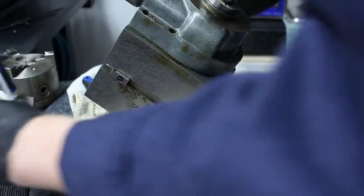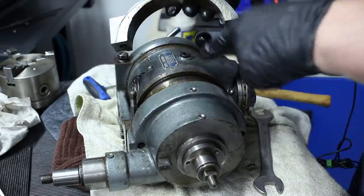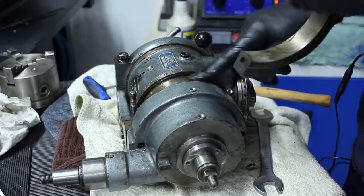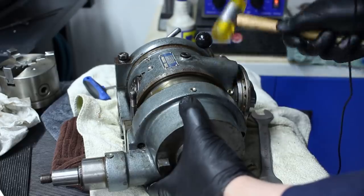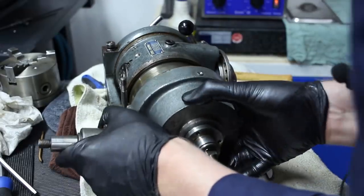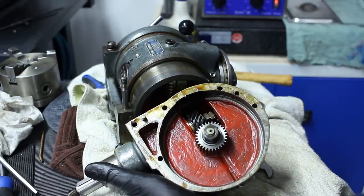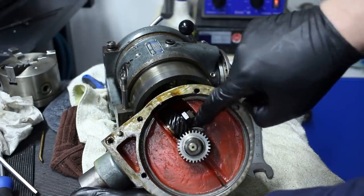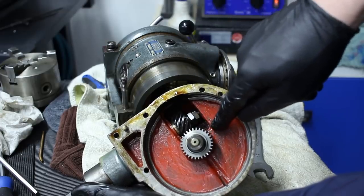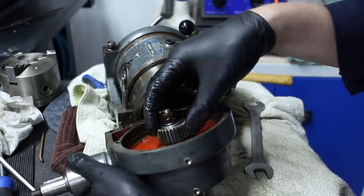There it is — that's the clamping element. Very nice machining on the inside, and this is ground. There is the smell of old oil. We have a gear — wow, we have a number of gears in here already. We have a worm gear here — or a screw gear, sorry. Screw gear is 90 degrees to each other. And that's a conical spur gear. I'm not sure if I've ever seen that before.